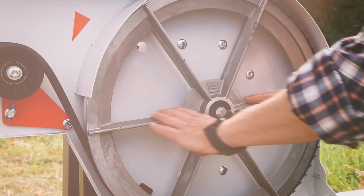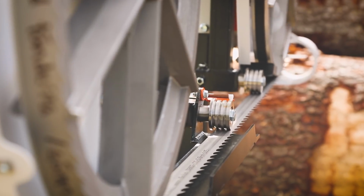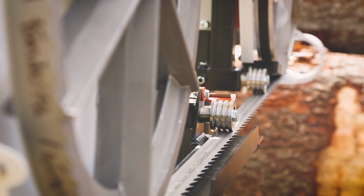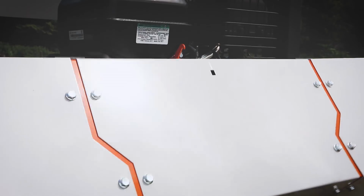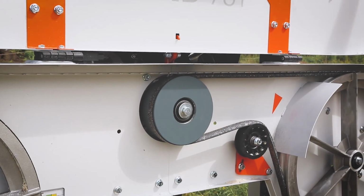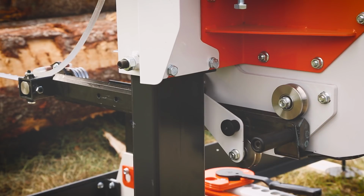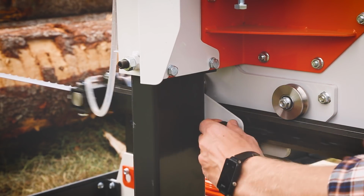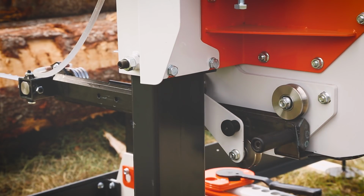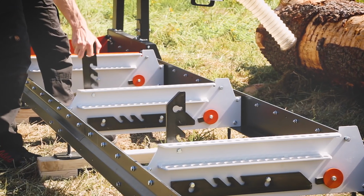The sawmill has a robust sawhead with light metal band wheels, measuring fully 50 centimeters in diameter. In addition, the band wheels have fan blades, which blow sawdust away from the sawmill at the same time as they keep it clean inside the sawhead. This facilitates when you are changing blades or carrying out maintenance and service. The blade guiding on the LOGOSOL B751 is exact, something you only see on significantly more expensive sawmills. The well-thought-out design gives a vibration-free and accurate operation.